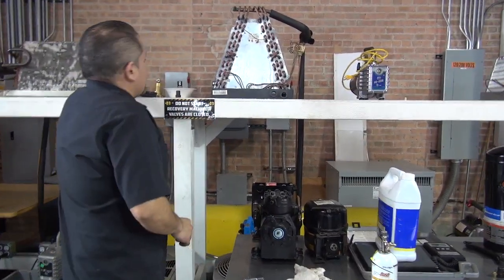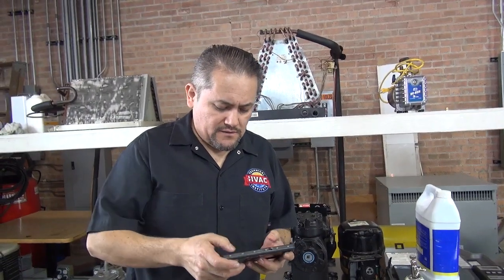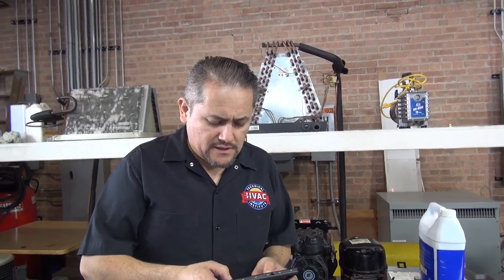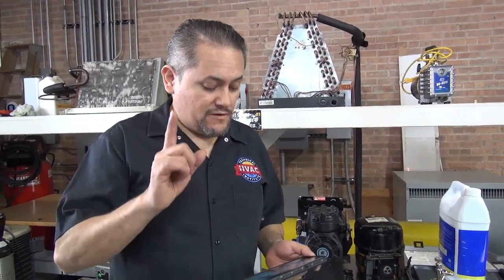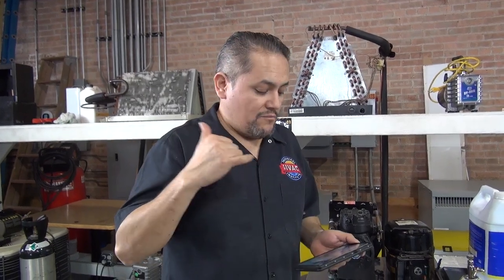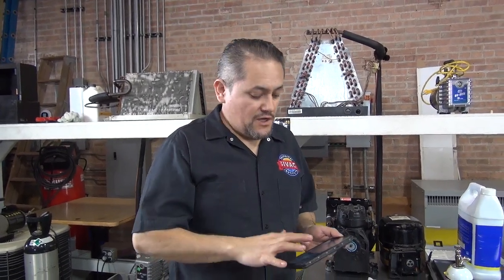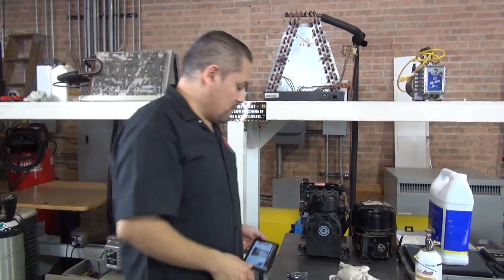Let me see if I can grab my phone. Here we go. Give me one second. Yeah, almost done. It's actually called Checkmate. I'm sorry. It's called Checkmate. And this brand, I don't have that one right now. I believe it's in my truck. This one will tell you the moisture contamination. It also tells you the acid contamination. We're talking about numbers, not just yes or no. It's actually telling you the level of the moisture or acid in the system. So it's called the Checkmate test kit. So that's another one that you can use.